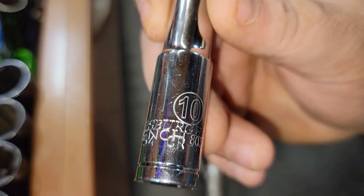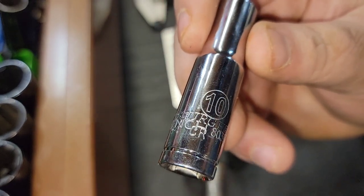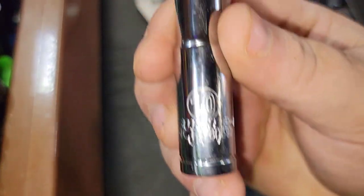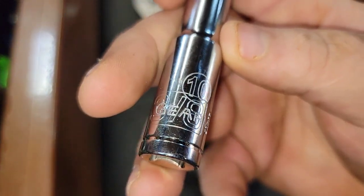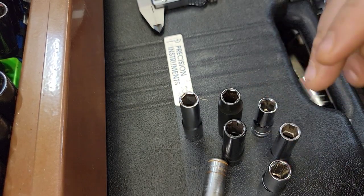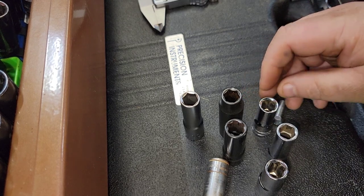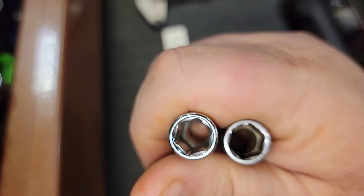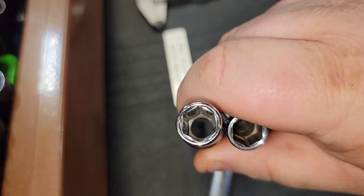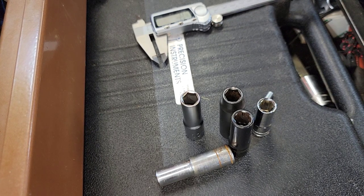Let's look at socket quality on this Pittsburgh — the 'shitsburg' GearWrench socket. GearWrench has an investigation launched on this. Let's look at sizing: is this actually a 10 millimeter or is it a 3/8? This Mac is a confirmed 10 millimeter — I put a 10mm bolt in it and it fits. When I compare it to this socket, I can already tell the hole is a little smaller. The Cornwell ratchet fits in there snugly, and I'm fairly confident this is a 3/8 socket.